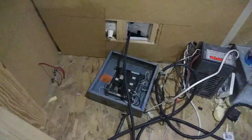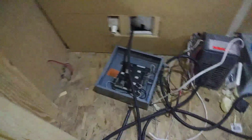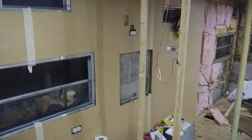I put in a slightly bigger breaker box — it was free, so I'm not going to say anything bad about it, but it works. The fridge is going right there on that plug, on its own separate breaker. The fridge and microwave will be on their own breaker, and then all the other outlets are run on another breaker.